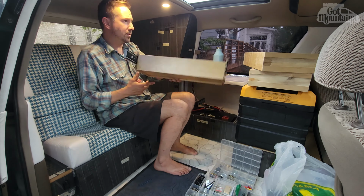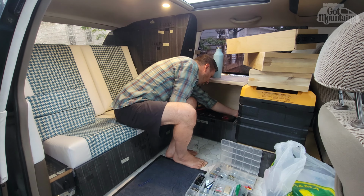Okay, so problem number 4,387. When I measured up this cabinet, I didn't take into account that the drawer slides need a quarter of an inch in front of themselves for the push action to work. So I have my pillars that the drawer slides are being mounted to in the wrong spot.